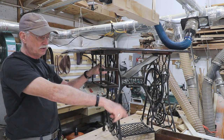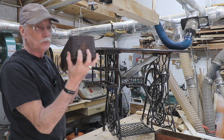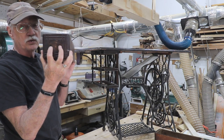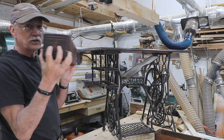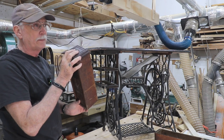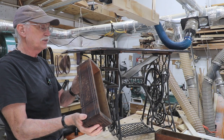I've also got to do the knobs for the new drawers and knobs for the old drawers, but in the new drawers there are two or three holes here. We're going to do one center knob in all four drawers, so I have to plug these holes with some side-grain plugs, because I'm going to put a finish on it to hide them. The gel stain I used on that chair restoration will be perfect for this. I can see this had shellac on it — it's got shellac all over it and it's failing.